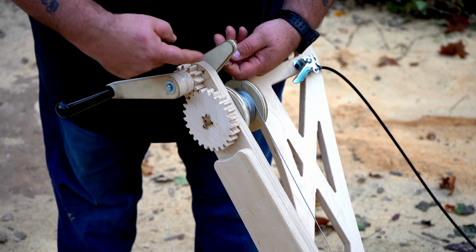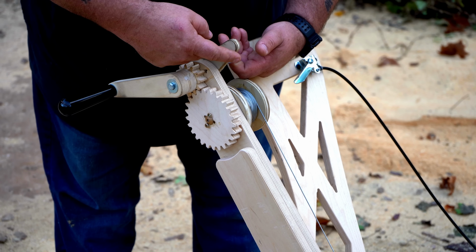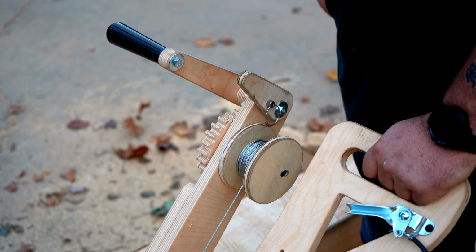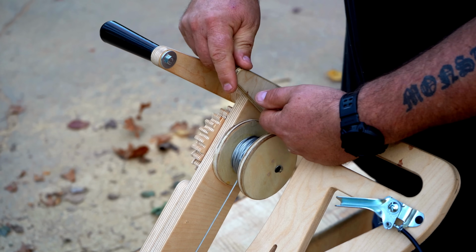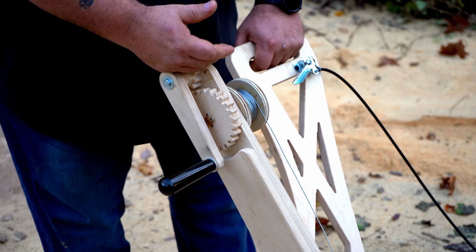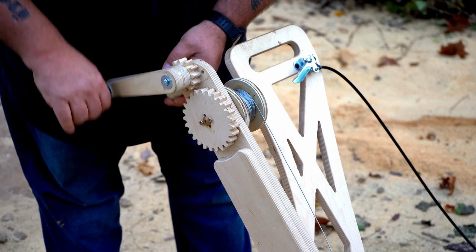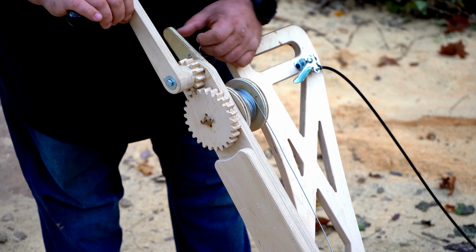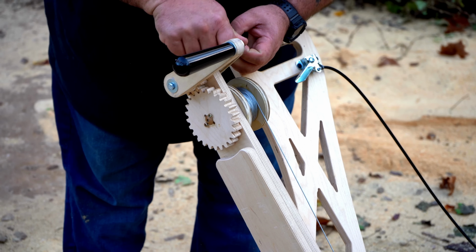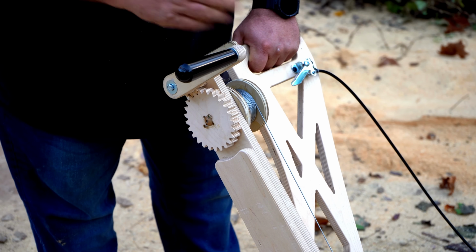But what I have here is this little lever with kind of a cammed or eccentric center. So when I pull there's a pin on this side, I'll show you that in a second. When I pull this pin, I can pull the lever out of the way. That disengages this handle gear, and then it makes it much easier to pull the saw carriage back. Now to re-engage it is simply just an opposite direction, making sure the gears are lined up, pop that little pin, and that pin locks everything in place, and then I'm back to business.